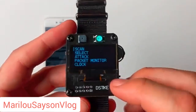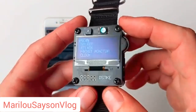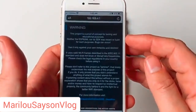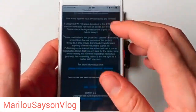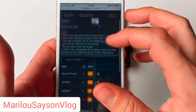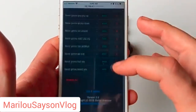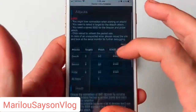In addition to being able to interact with the watch through the hardware on the watch itself, the watch also throws up an access point called 'pwned' with a default password of 'deauther.' You can change all that in the settings, but once you've connected to that access point, you can navigate to 192.168.4.1 and click through the captive portal to see the scan interface where you'll see the results of scans. You can go to SSIDs and configure your SSIDs for the beacon attack.